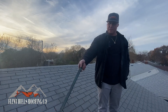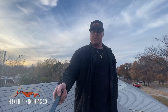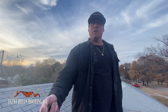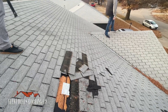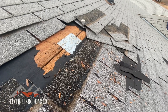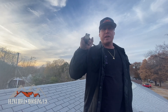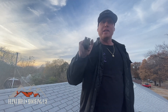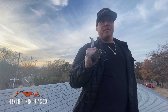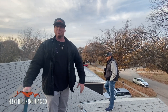Slat decking. What we have here is slat decking, not solid sheathing. And by code where I'm at, you have to have solid sheathing — 4x8 OSB 7/16 deck boards. So I have 88 shingles that need to be repaired. How do I change to solid sheathing when I'm only changing 88 shingles? I called State Farm and asked them what to do. They were kind of lost for words for a second, then they said: give us a full replacement estimate and send it in. They're doing the right thing — it has to happen. Because they had code coverage, now State Farm is covering it. At least you guys know how it gets bought, because I've had two other salesmen drop the ball on this job. But Big Daddy got full replacement — boom, out of the park.